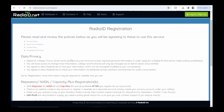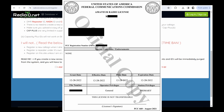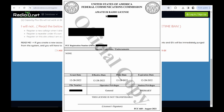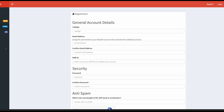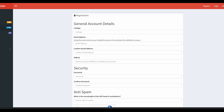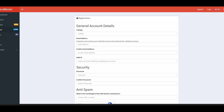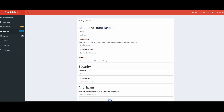After watching through his tutorial a couple of times, the next thing I did was go to radioid.net to register for a DMR ID. I will give you one quick tip here: the only license proof they'll take is one of these PDF official copies, or a photo of the real full-size license. They don't want a photo of the wallet-size license or anything like that. So make sure you've got that in order before you go over there and start this process or you're going to get frustrated. Once I had my DMR ID issued — I think it was about the next day — I was able to take that over to brandmeister.network and register there using my call sign and the assigned DMR ID.